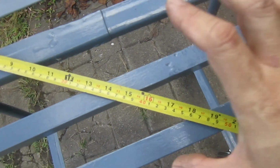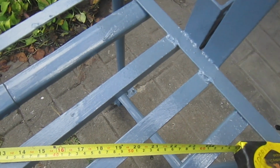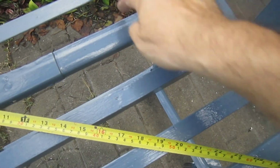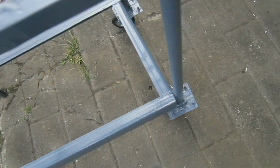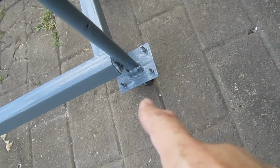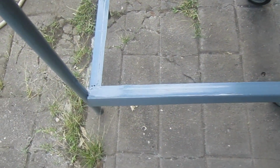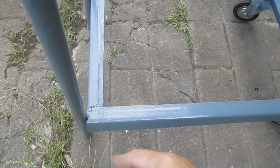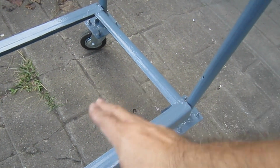You'll be placing the coconut here. The blades will be here and then you'll be chopping the coconut there. So just make use of scrap angle bars. And then I decided to place wheels only on the front portion so that I can position this anywhere. Since you will be exerting much force in chopping the coconut into two, it's best if the table won't be moving. So only 2 wheels in front so that you can bring it anywhere.